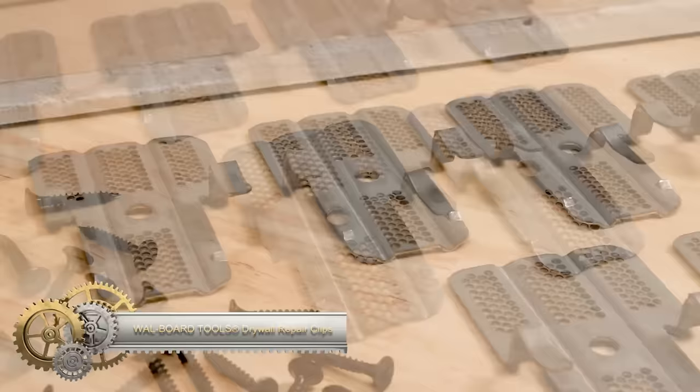The REFCO hydraulic expander is a pivotal tool for professionals dealing with copper or aluminum pipes in sectors like plumbing, air conditioning, and refrigeration. This tool comprises a handheld pump, hydraulic cylinder, and interchangeable expander heads that cater to varying pipe diameters. Its operation involves selecting the right expander head, securing it into the pipe's end, and manually pumping until the desired expansion is reached. Notable features include its hydraulic mechanism for consistent expansions, adaptability of its expander heads, portability, and straightforward usage.